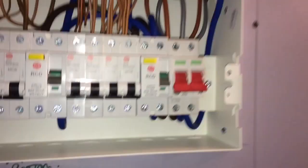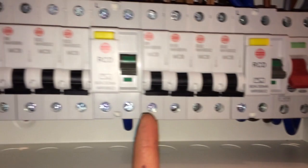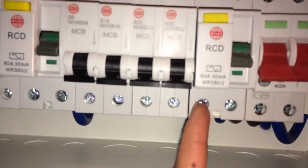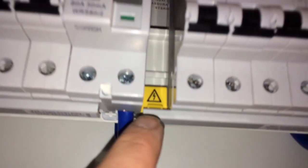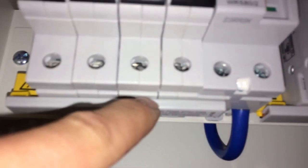The board is now all connected. Next thing to do is put the busbars in the bottom there, get all those connected, and tighten all the screws up. You put one end in and connect those up — there we go, the busbars are in. When you get a spare section they give you nice little covers. When fitting these, make sure you get all the screws back because you don't want to miss a gate on the bottom of the breaker.